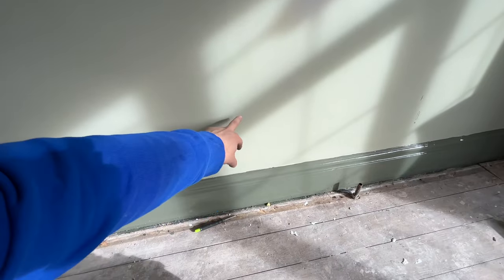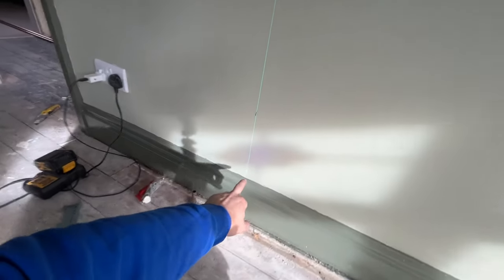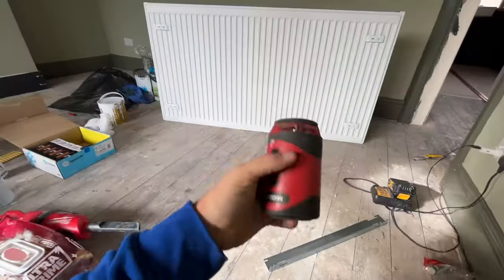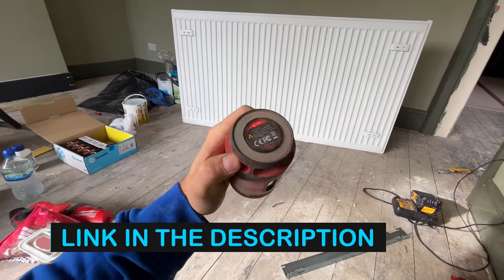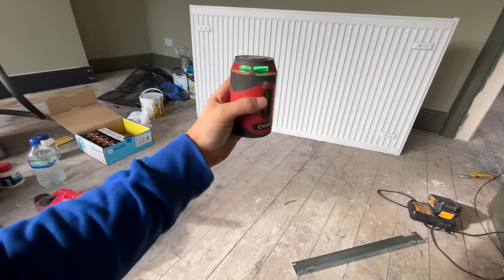The 1,400 that's going on the living room wall here — what I'm doing is centring between the two plug sockets, which comes to 109.5cm, marked there. Then centre between the brackets — we've got a cross, 60 that way, 60 that way, so we've got 1,200. Then we're going off the top of the skirting, two foot up, basically, levelling across. And we're using our Sigmund — the Coke Can model, let's call it. I'll put the link in the description. Does it say the model number on it? It doesn't, I can't remember what model number it is, but I'll put a link in the description below.